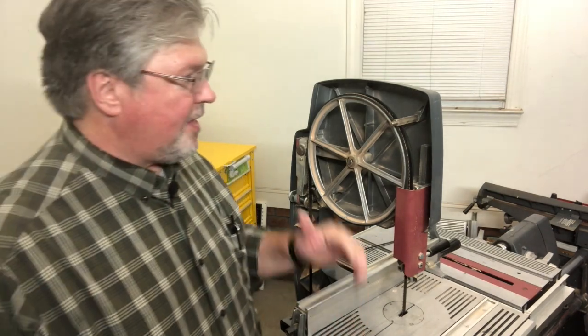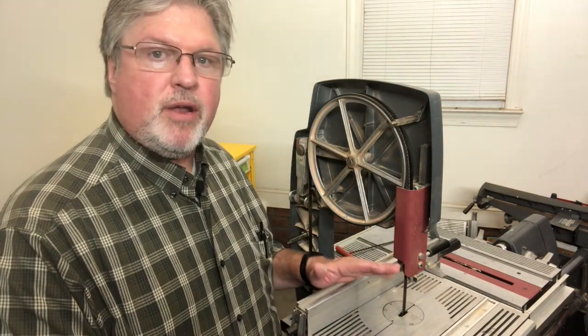If you own ShopSmith equipment and the ShopSmith bandsaw and have been frustrated after reading one of those articles, we're going to talk about what makes this machine different — and in my opinion, superior. This bandsaw does not have a crowned wheel. Instead, the bottom wheel is perfectly flat, and depending upon when it was made, the top wheel is either flat or has a slight conical shape to it.